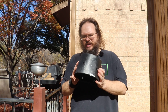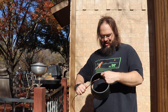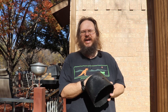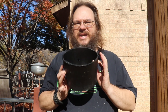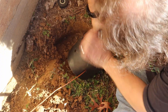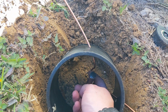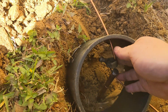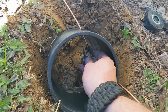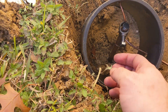I got all that sorted. Before I put this back on, I was looking at the hole and thought it would be nicer to have a third hole — run it in and out instead of on the other side, closer and pointing to the house, so it can go straight up the wall. I performed the twist here: we got a 90-degree bend and another 90-degree bend, then we got this locking lug nut. You take the locking lug nut, turn it flat against the 90-degree bend, and bam — it pulls right in to the ground rod. Look at that!